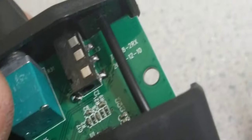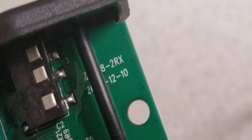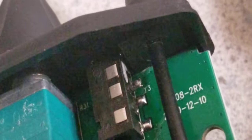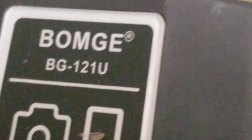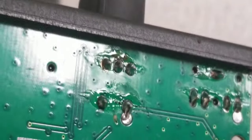You can see the bridge between the two — that one connects to that one. The one at the top is ground. So there is no left and right channel. It's just two receivers going to one single processing IC, which is not stereo. Even the potentiometer is not stereo, so it would not adjust two channel levels — it's all one channel.